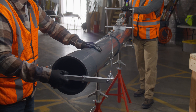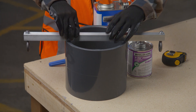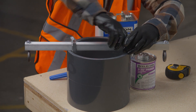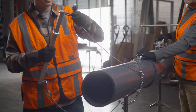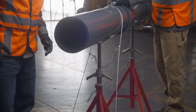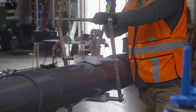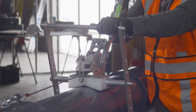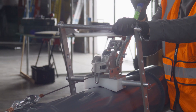In this demonstration, we're using the Weldon pipe puller tool to assemble the joint. The socket bar attachment, used for inline fittings, is placed equal distance over the center of the socket entrance. Two adjustable locks keep the bar centered on the fitting so that an equal, even force is applied, keeping the fitting from cocking to one side and producing a large undesirable gap. Force is transferred from a cable winch to the socket bar by means of a cable yoke that splits the force and helps produce an equal, even amount of tension necessary to bottom out large diameter fittings.